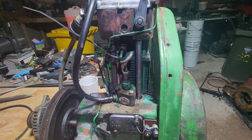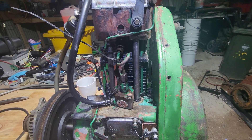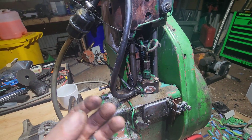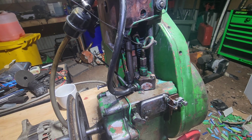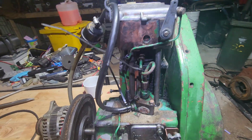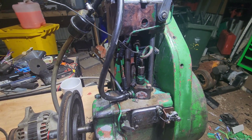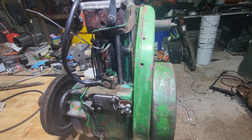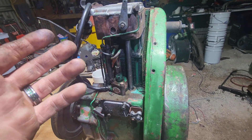It's black because it's waste motor oil and unleaded mixed together to blend the viscosity down a bit. These direct injection engines absolutely love it — it's the best kind of engine to use waste motor oil in. Same potentially with biodiesels. The carbon doesn't matter because if it drops in the center of the piston it can clean itself out and keep running pretty clean. You don't get misfire sounds from blocked combustion ports, which is one of the biggest dramas with running waste oil in other engines. My Yanmar generator, purring in the background right now, has absolutely no problems running waste motor oil at various viscosities.